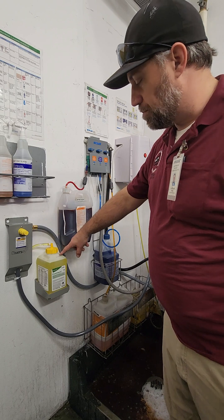One of the common things a lot of people think is this new device right here is broken. It is not broken. It is supposed to leak water. So when I turn the water on at the faucet, you'll notice water is now coming out. That water is supposed to be there — that's letting you know that the system is pressurized.